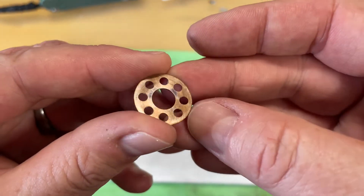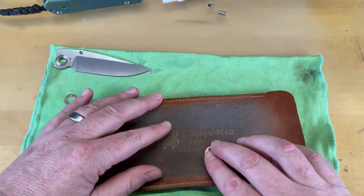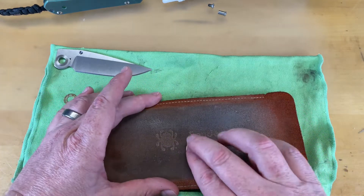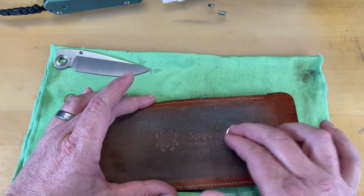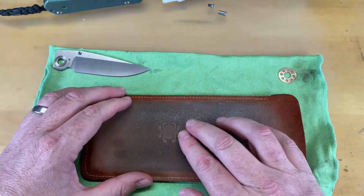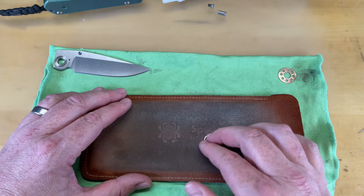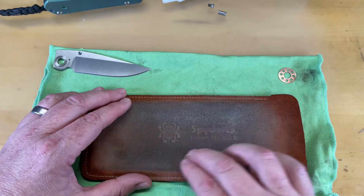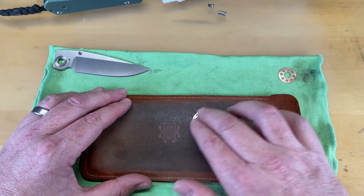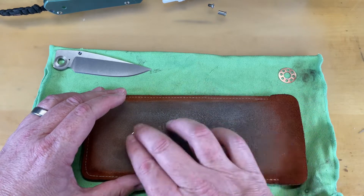Then all you have to do is put the knife back together. Some people will use a strop. I've done it on this leather here to do the final polish because it is loaded — just a couple of figure-eight passes on the loaded side of the strop. What you're doing is basically giving yourself a much cleaner, smoother surface that's going to have less friction. So let's do both sides. Since we did it on the stone, we may as well do it on the strop. That's going to take off any corrosion and things like that that might have formed on it. That figure eight allows you to make sure you're getting all the surfaces — give it a little turn. This leather is nowhere near as abrasive as the stone, but it gets into all the little points and polishes it up.